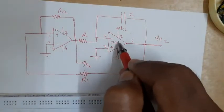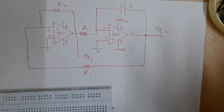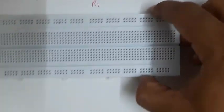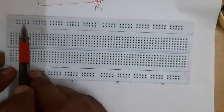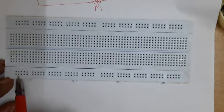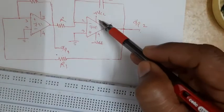The discussion of theory is not the part of today's video; we will just keep the circuit for reference and connect it on the breadboard. We will use random values of capacitor and resistors R2, R1, R, etc., and here we will be using op-amp 741. Now, what are the basic steps? When we connect the circuit we will have to fix the lines - I will assume this upper line as VCC.